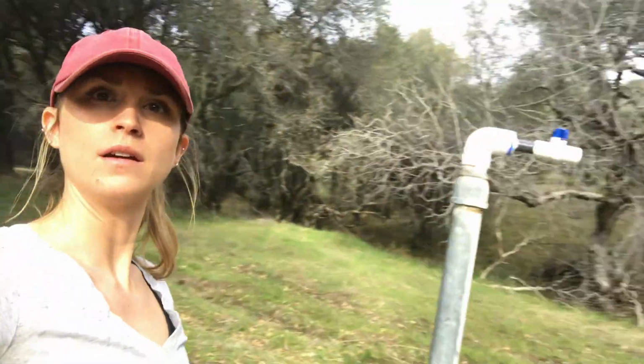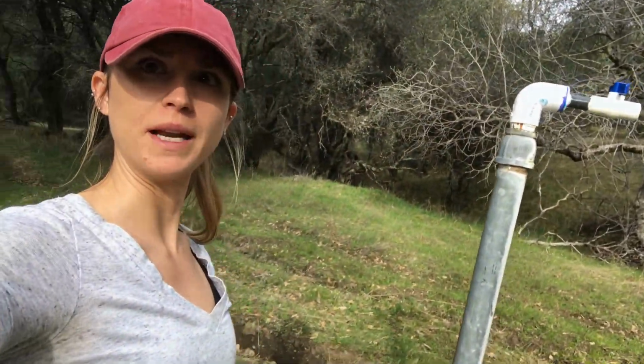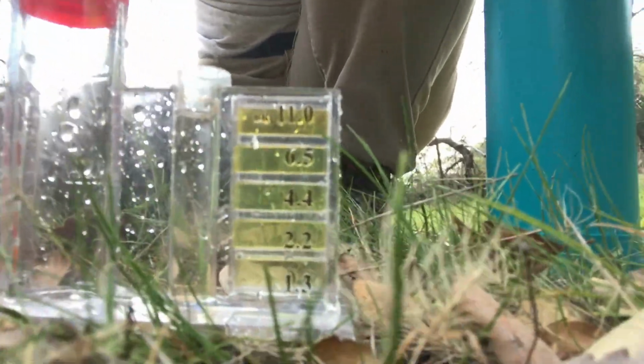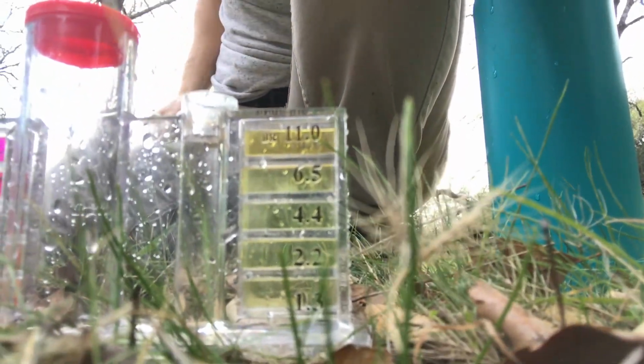So I'm going to use the south well to start distributing clean water to all of our hose bibs and start checking off our fire hydrants and hose bibs that there is no longer high concentration of chlorine at each one. Hose bib go for about, I don't know, a minute or two, and it's starting to smell a little bit more fresh, but my nose and nostrils so tainted from smelling chlorine all day that we're gonna make sure with this beaker. So this will be test number 2.